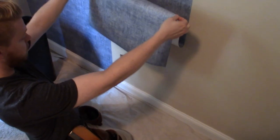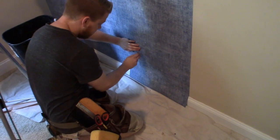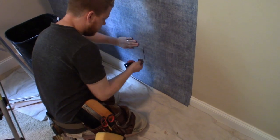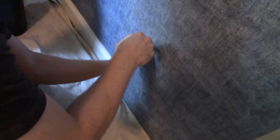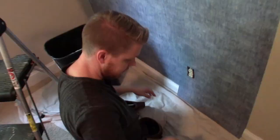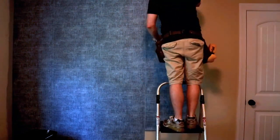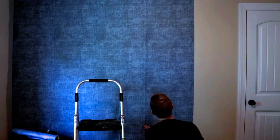As we're dropping this piece down, you'll notice there's an outlet on the wall. You can hang right over the outlet, find your corners, and use your razor knife to cut right along the inside edge of the opening in the sheetrock. Remember, it's better to cut your hole too small than too large — the switch plate needs to cover it. You can flip the breaker to the bedroom so you won't risk electrocuting yourself, but that cuts your lights off and makes it harder to see. Wallpaper wears a razor blade out quickly, so change it fairly regularly — every one to two pieces.